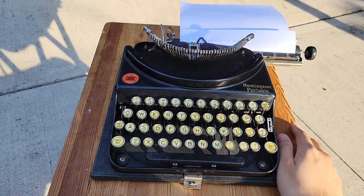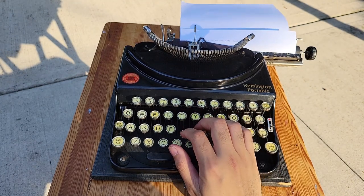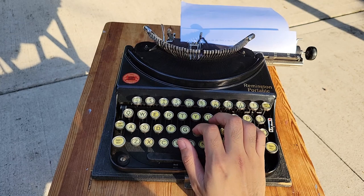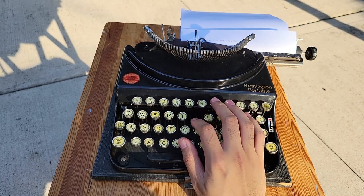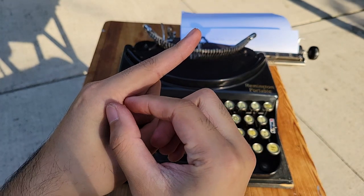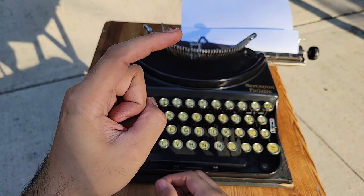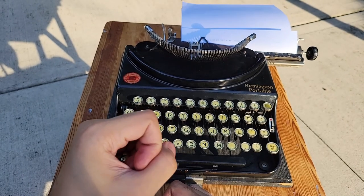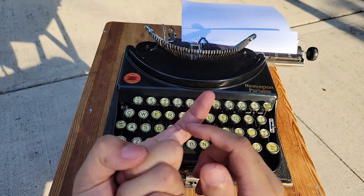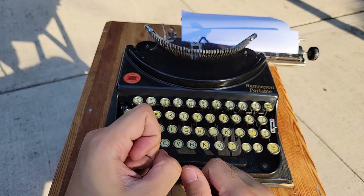Now, my definition of snappy on typewriters is basically, it's kind of the equivalent of what I call an inertial feel, or where the inertial component is more dominant. So by inertiality, I mean that, so you either have a spring, a plain spring, which will normally have a linear force curve. So if you go 1 centimeter, it will be this force. If you go 2 centimeters, the force will be doubled. On some typewriters, the leverage of the mechanism as well as the inertiality may cause the force curve to go like this, or like this sometimes, like on some Smith Coronas. This is what I associate with the Hermes machines as well as the Adlers.